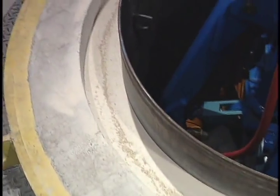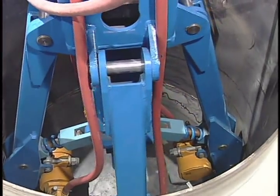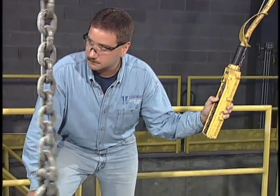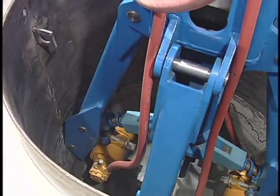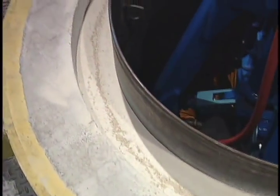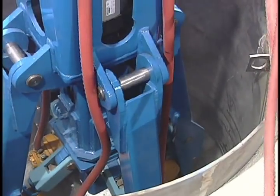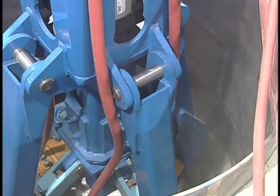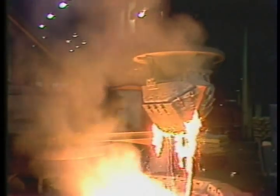About 50% of vibration time is concentrated in the tapered section of the form where maximum compaction is critical to longer lining life. Our vibration technique dramatically reduces or eliminates troublesome erosion, or elephant's foot, in the tapered section of the furnace. The machine is slowly pulled up the form, ensuring equal treatment for the entire length of the parallel section. Total sidewall vibration for a 10- to 60-ton furnace is kept between 12 and 16 minutes, translating into substantial time saved compared to conventional methods. Now the sintering process and production can begin much sooner.